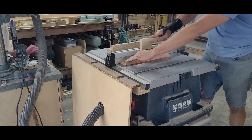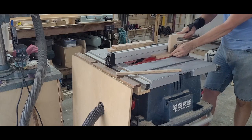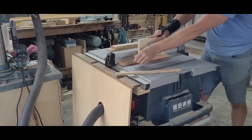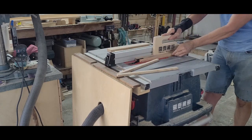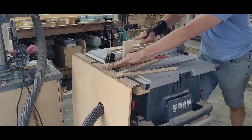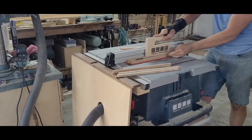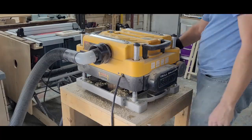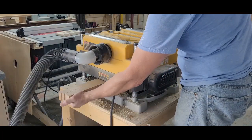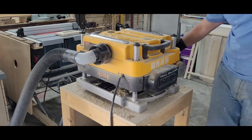I wanted the plywood to sit up about 1/8 of an inch up from the bottom, and the tiles to sit about 1/2 inch below the top of the frame. After measuring the thickness of the tile, the plywood, and the spacing, that gave me a width of 1 5/8. To leave me some stock for cleanup, I set my fence at 1 11/16. A few light passes through the planer and the machine marks were all gone, and I brought the stock down to its final dimension.